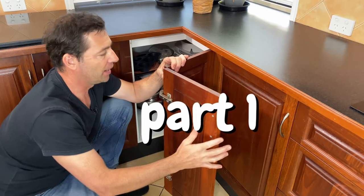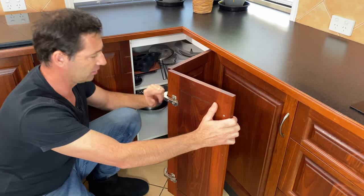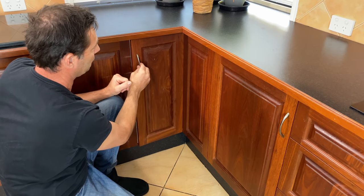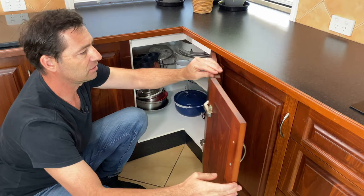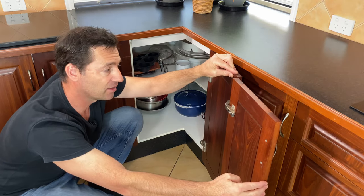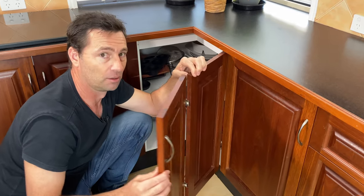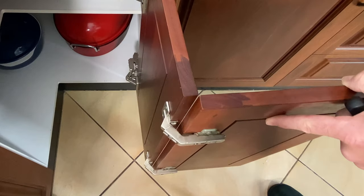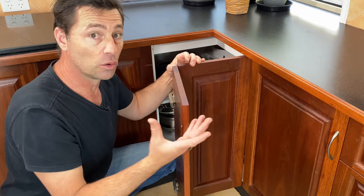Let's be systematical about it. We're going to start where these two doors meet and look at the hinges here. Normally they sit at a 90-degree angle. We have to open them a little bit more to open the cupboard, and for access we actually get them quite flat against the other cabinets. They're called bi-fold because they swing both ways. Our goal is to get these two doors to nearly meet at the corner but not touch, as that would cause them to rub and damage the surface, and cause the cabinet doors to bind.